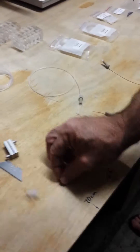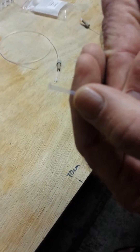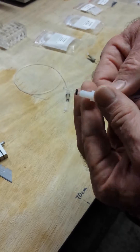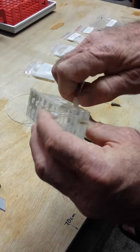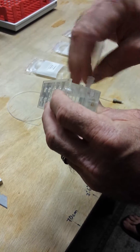A flanged fitting, by contrast, is consistent and smooth. It never has a disturbance in the tubing and it's a true finger-tight fitting. When you screw it in you just simply lightly tighten — that's it. It seals without compressing the tubing.